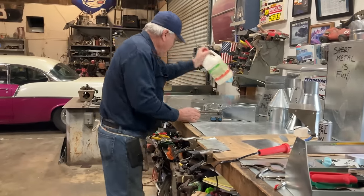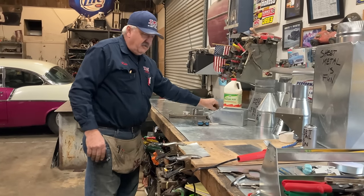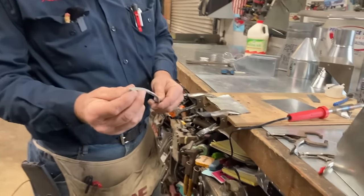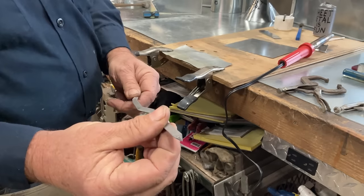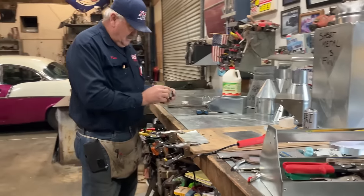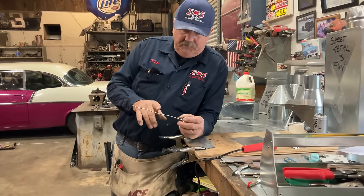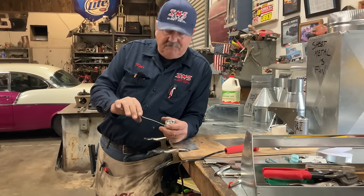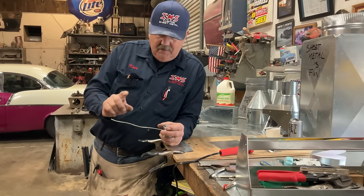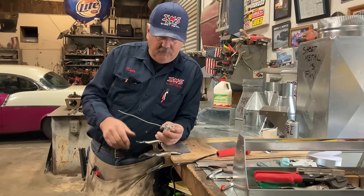All right. So what we're going to make today, ordinarily at a sheet metal shop, we would use tri-bar solder. And that's because it has three sides to it, tri-bar. But what I want to use instead is the smaller solder. And this is actually old school lead solder. This is 50-50. The first number is the tin ingredient, T-I-N. The second number is the lead. So it's 50% tin and 50% lead.